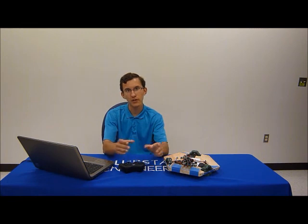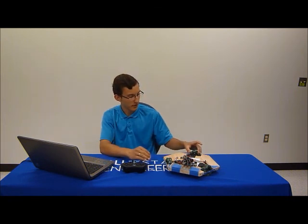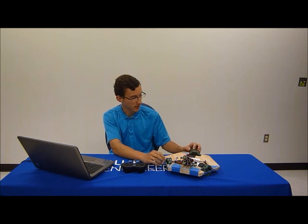The other problem was that instead of using the servo.write function, I use servo.writeMicroseconds. The difference is that it allows for a much more precise input value — instead of the .write function which only has 181 input values, writeMicroseconds has 1001 input values, and that allows for a lot more precise control, so the motors were much more cohesive in their movement.